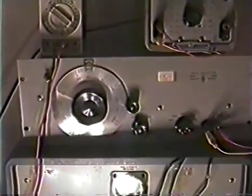And now we're focused on the actual little oscillator that's providing that input power. This is a Hewlett-Packard audio oscillator, model 201CR. The maximum power this oscillator can put out is only 3 watts when it's at full peak power. It's 600 ohms, and it's going out into 600 ohms.